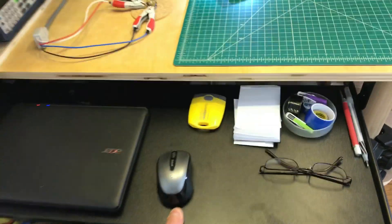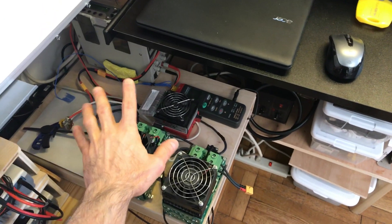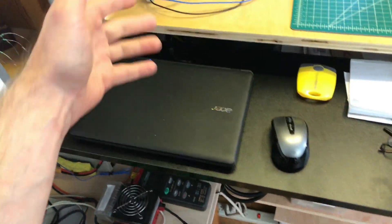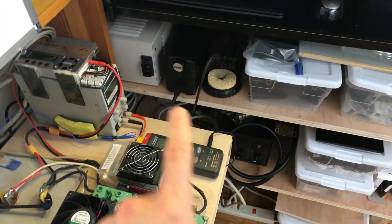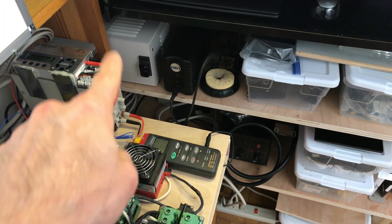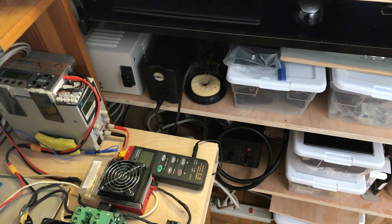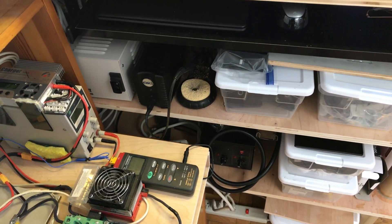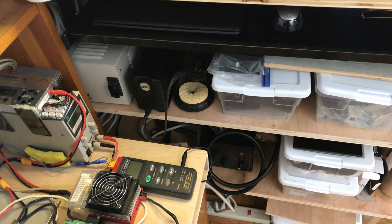We now have a keyboard drawer — this laptop is used to run the system down here, so it's easy to just open it up, run the tests, and then put everything away when not running battery tests. Different storage over here. This is an isolation transformer with workbench test-bench modifications made to the grounding — that's how you keep your oscilloscope grounds from exploding if you make the wrong kind of connection when testing something powered by AC, like a wall wart.